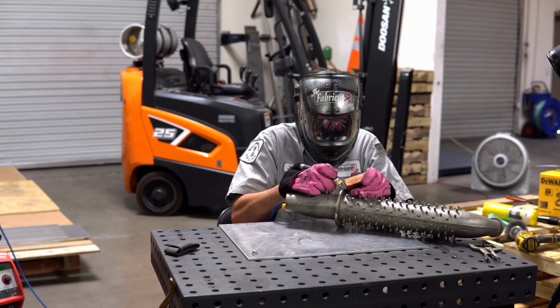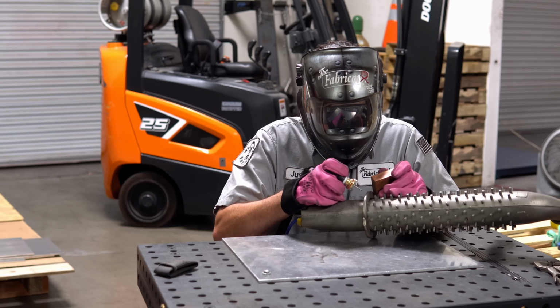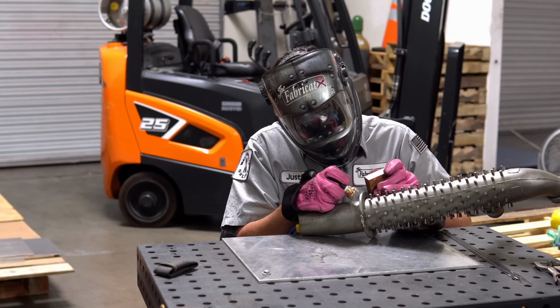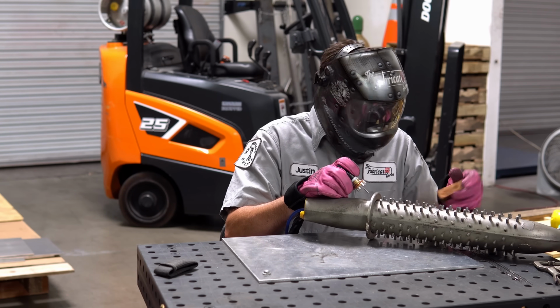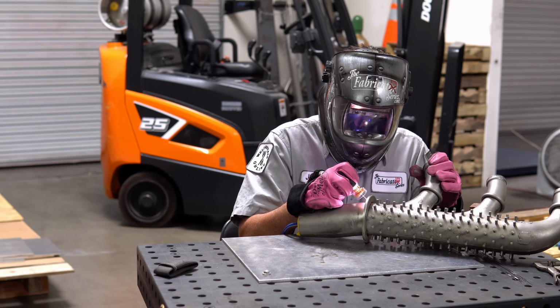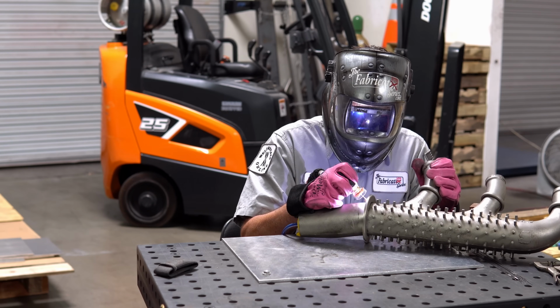But let's get a few on here to compare it. This was probably sand that was used to blast this, because it looks like some silica deposits are floating up into the weld. Oh yeah, we got little dots all over the place. We'll get a close up of this in just a minute. Yeah, I don't know if you saw that one, but something just popped at me.